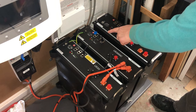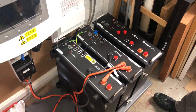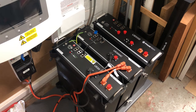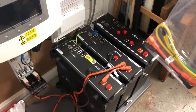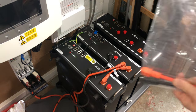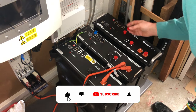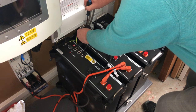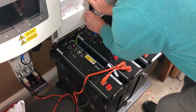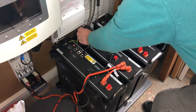I'm now going to switch the remaining batteries off and then isolate them from the inverter — nothing really matters which order. We'll probably see an alarm come up shortly because there's no CAN signal, and now we're going to isolate the battery completely from the system. By gum, that's a pretty meaty earth cable — so just to be safe, although it is switched off, I'll temporarily put those back on just lightly. The electrician who put those on certainly had his Weetabix for breakfast.